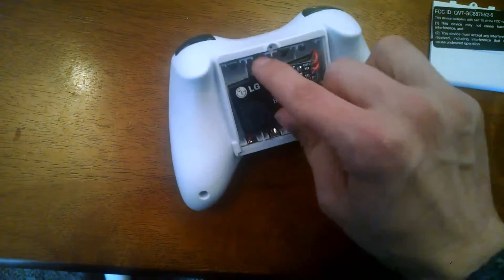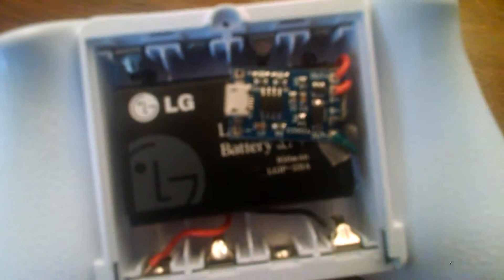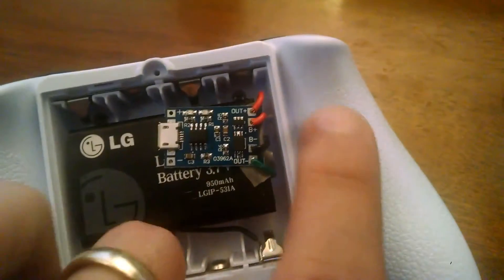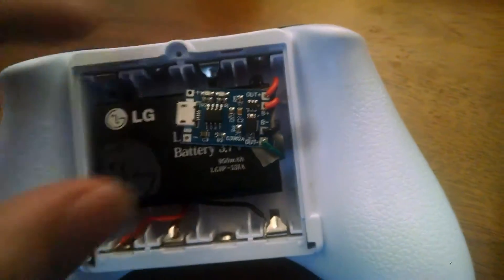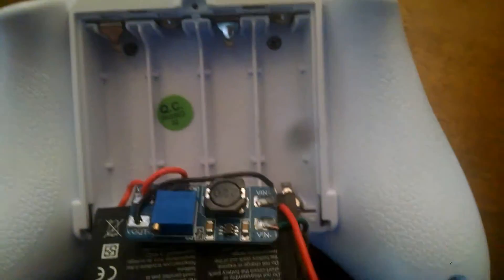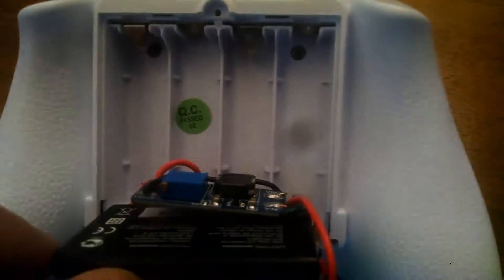So I had this cell phone battery from an old cell phone, and I connected that to this cheap single-cell lithium charge controller. This has charge control and dropout circuitry, so there are mosfets here that will monitor the battery voltage and cut the output voltage when it drops too low. And then I have a little boost converter here which I've set to five and a half volts — it could be six, but five and a half worked fine — and that's to power this thing.